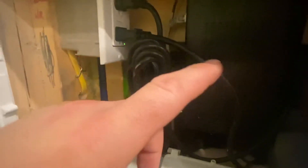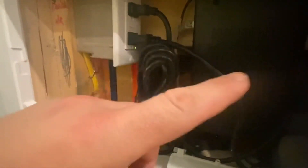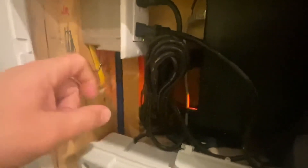You're going to need to have a power source in here; obviously you're going to need to have a GFI. This kind of looks like a mess in here, but when you run your wires you're going to want to have a drip line. What you do is bring your wire down and run a little loop so that if water does get in there, it'll run down the wire and drip on the ground versus going back into your circuits.